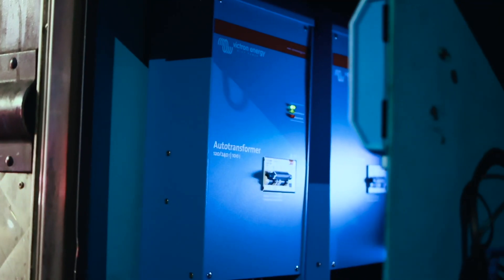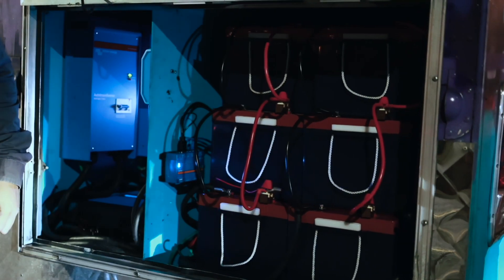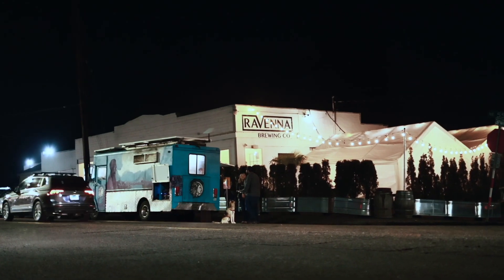From there, we went into two transformers to step down into 120 volt AC, which is what everybody uses. At that point, you have the scalability and the versatility of the system to be able to offer 120 as well as 240 volt outputs. The 48 volt 96 has done amazing. The BMSs inside have held up to the cold as well as the heat we had this summer, as well as our now winter — we're sitting outside at roughly 30 degrees and the batteries are doing amazing.